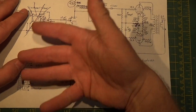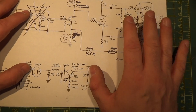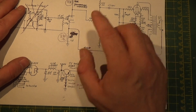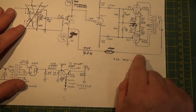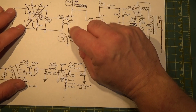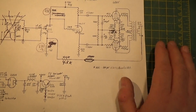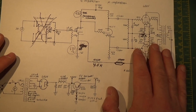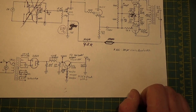If you go more than this, it brings too much feedback in and just lowers all of this too much. Conversely, if you went even to 4.7K you would start to get a little bit of distortion. So it's very critical. This should be the very last thing you do, and it was the very last thing I did. I did most of my tests with no feedback connected at all — I disconnected it over here at the speaker terminal. Got everything to work, got everything to look good, then went back and added my feedback and adjusted things from there. Again, it's a moving target, but once you zero in on it you'll see it and you will get really good sound.